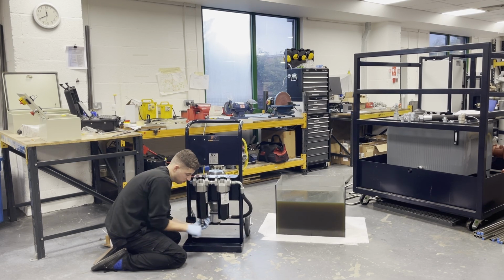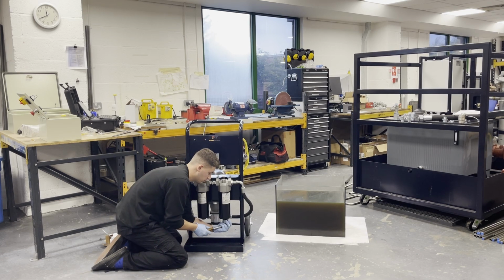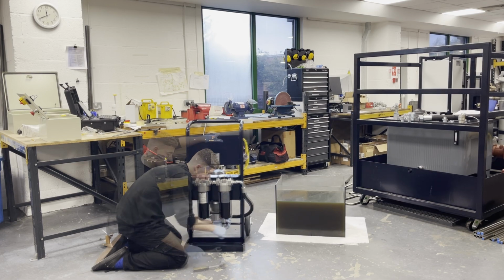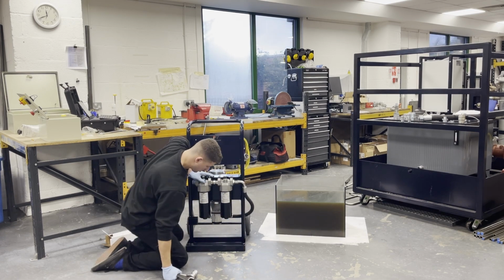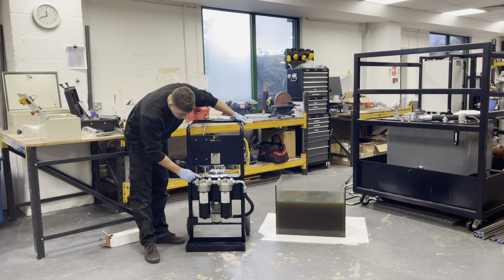Once you get to the end of the thread, it will start to tighten and you'll just need to nip it. It doesn't need to be super tight, as there is a huge amount of thread, and these filters are designed to go right to the end before it stops. The sticker will align up facing the front, so you know it's right at the beginning.